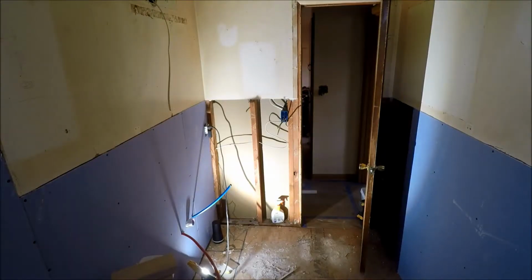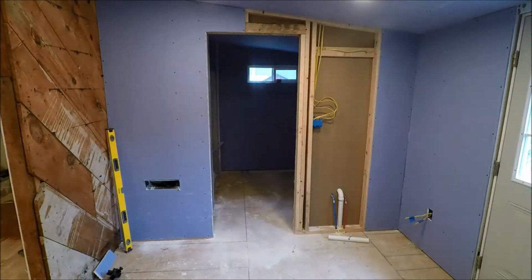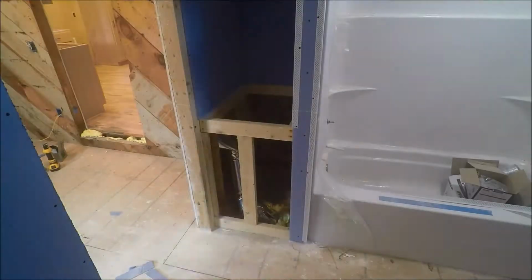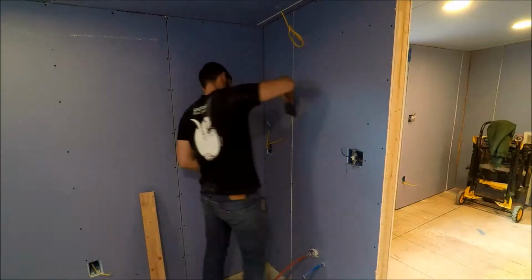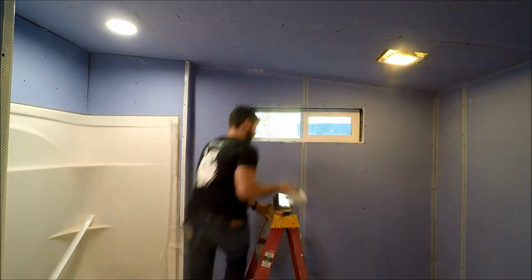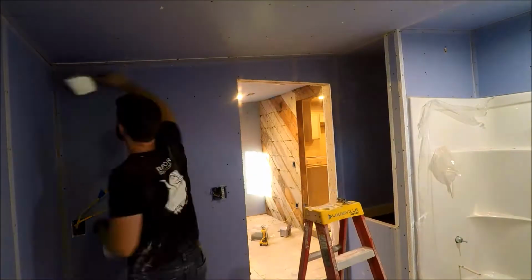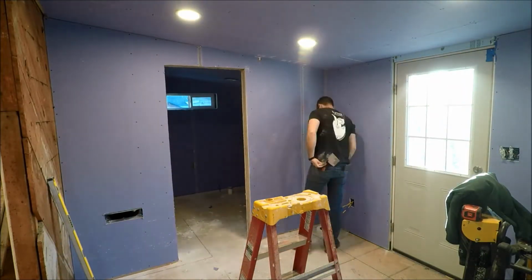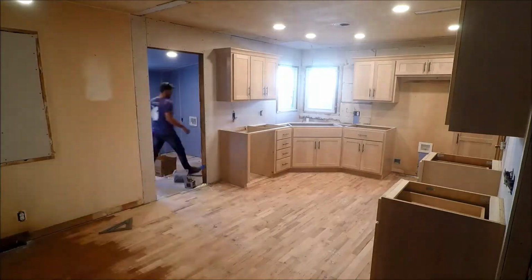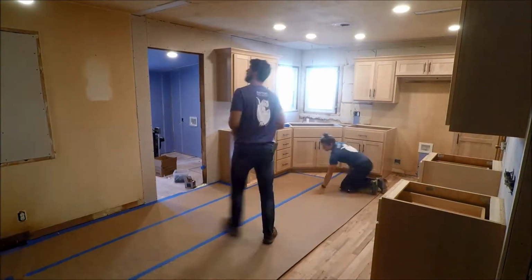Anyway, the reason for not combining your drywall is because, actually, in some situations you may be able to, but the reason here was our old drywall was much thinner than our new drywall, meaning where we were adding our patches, we had a much larger ridge. And mudding ridges is no fun. Yes, you have to feather your mud out further, so it's not a noticeable change, because all walls have little bows in them here and there, but whenever you mud, it evens it out. But for that instance, it just kind of has to show a little more.